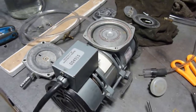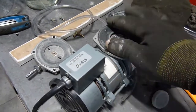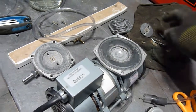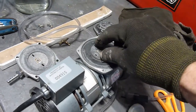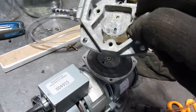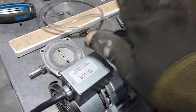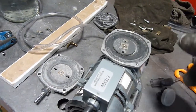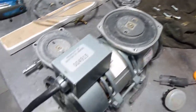This type of vacuum pump — a very common style of design — uses a piston. The piston runs a rubber diaphragm that actually forms the seal, and then this clamps it in place to the piston. I can see why the reed valve was floating around because that nut matches the screw and it comes through from the top. So you put both reed valves on and then put the head on top of the piston. I'm going to give this some rubber renew, clean it up, clean the corrosion off everything, clean the reed valves, and put it back together.